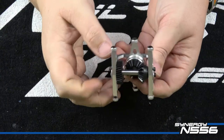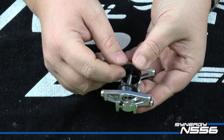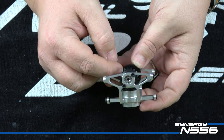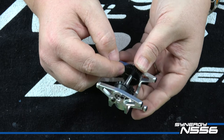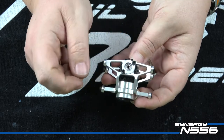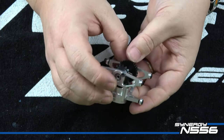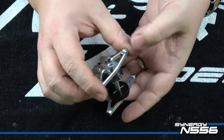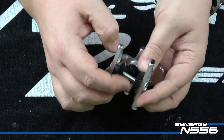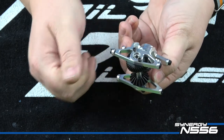Here's the transmission completely reassembled. One thing I forgot to mention: when reassembling, use a little red Loctite on the auto-rotation drive gear. It is captured and can't slide, but without Loctite the load cycling over many flights can elongate the pin holes over time. The Loctite keeps it tight with no slop. A little warmth from a torch will melt red Loctite and let you push the pin right out. The mesh is perfect and there is no lateral movement of the shaft at all.